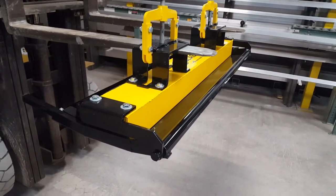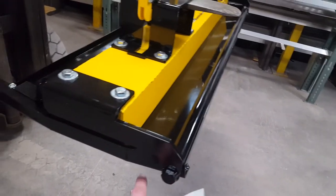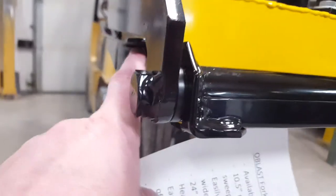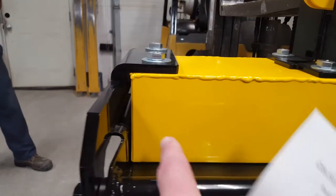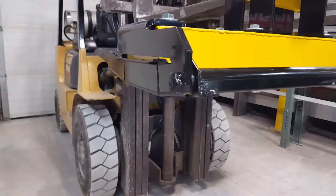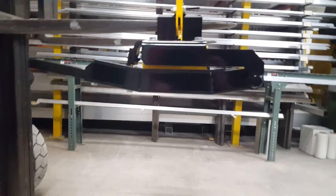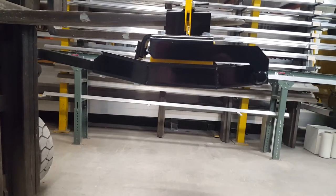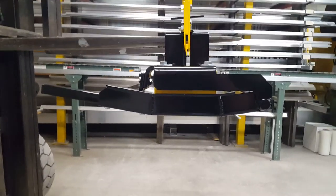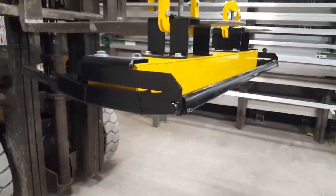The unit features a stainless steel magnet housing, stainless steel debris pan, stainless steel front tube, and stainless steel sides. The corners of the debris pan are designed to fit just inside the magnet, so if you're skidding it around in a yard, you won't damage the pan. The debris pan is also angled — not flat on the bottom — so that if you tilt the forks, the length of the magnet on the ground doesn't change and you won't dig the front corner into the ground and wreck the pan.